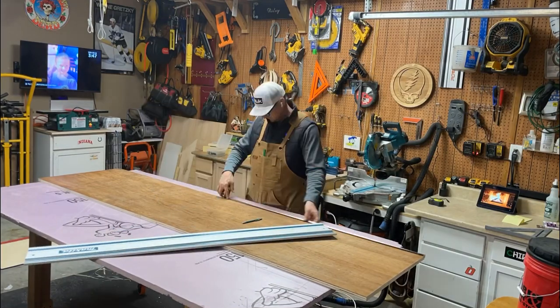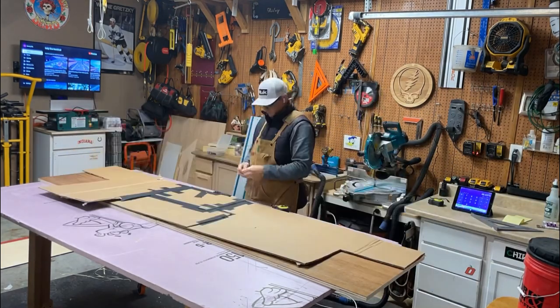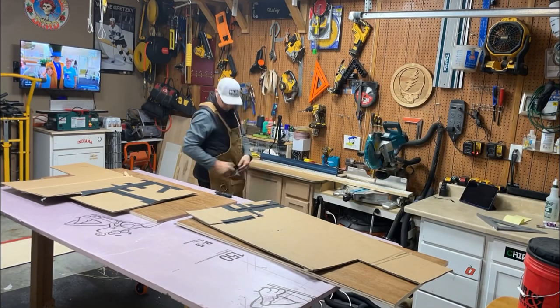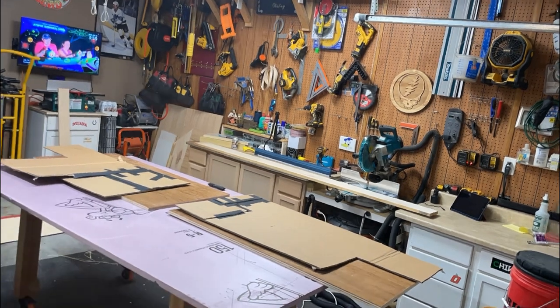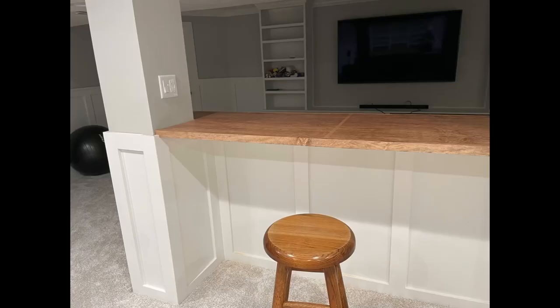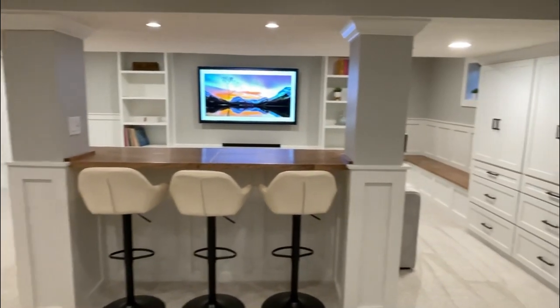I did a cross cut and made a template out of cardboard from their sofa boxes to make sure I had it perfectly right on exactly where I wanted it, then brought it to my house, laid it out, and set it up. Down the middle I used three-quarter inch plywood to give us a little more length, then ran three-quarter inch facing around the edges and sides - it worked out pretty well. After getting the top in and putting a couple more coats of sealer on it, this is our finished product.